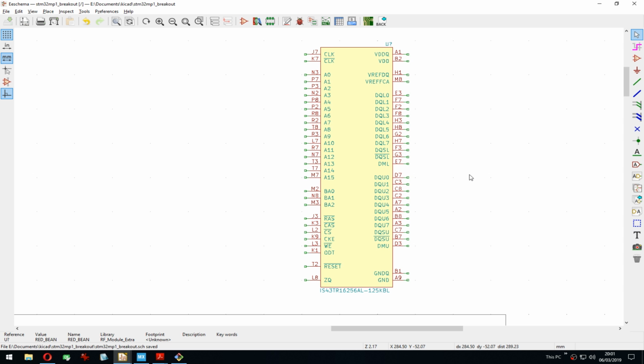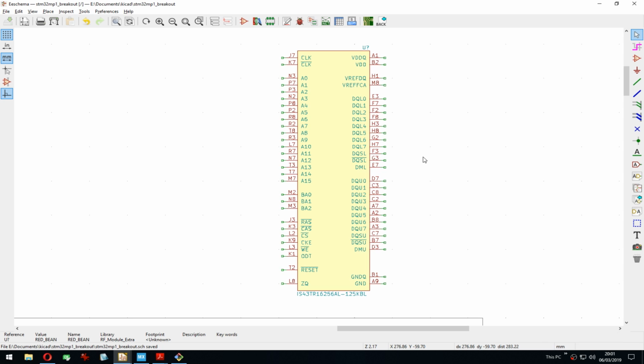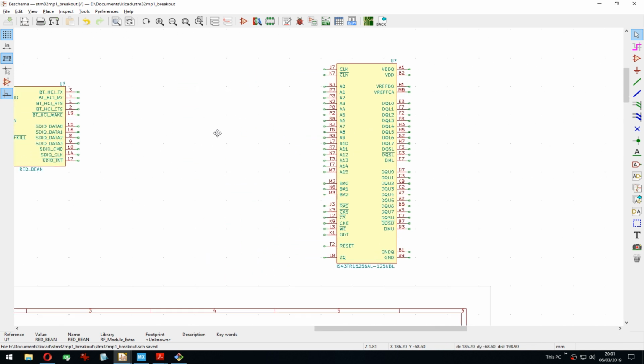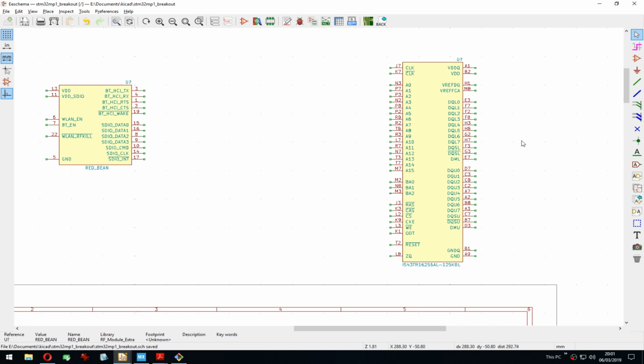I could actually go lower, to 256, but then it will depend on how much RAM I want to share for the graphics memory. And I'm not sure exactly how much. If it's like 128, then if I use 256, I will only have 128 megs of RAM left. So we'll see how that goes. I will just need to try it out and see. But yeah, this will be one